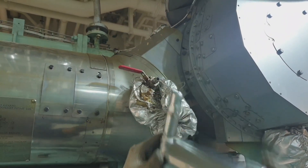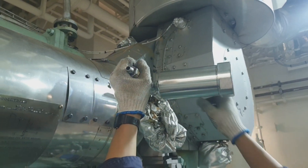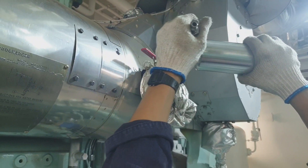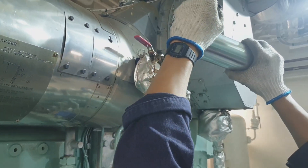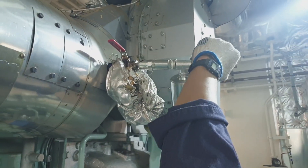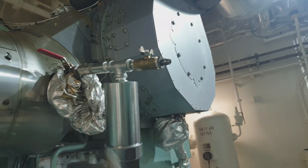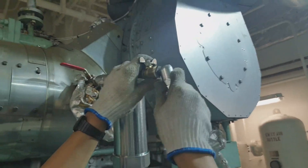This is the air hose for our supply air, which is seven bar. Just connect it to the injection valve — that is the exhaust manifold — and connect the blow gun filled with granulate slowly. Our granulate is 1.0 millimeter in size, as per manual instruction.